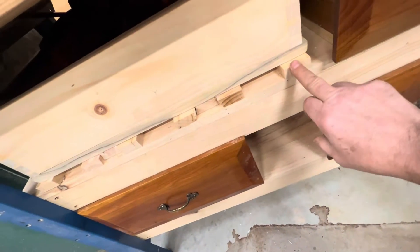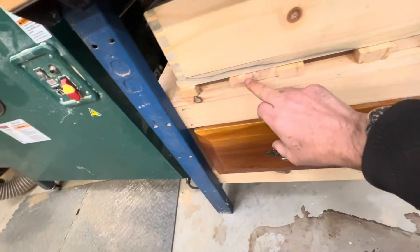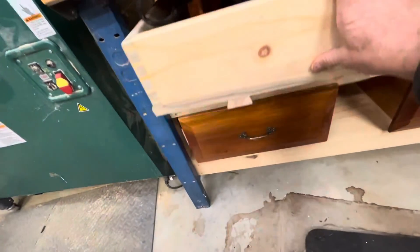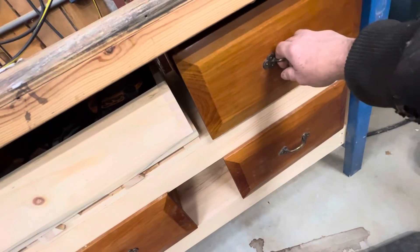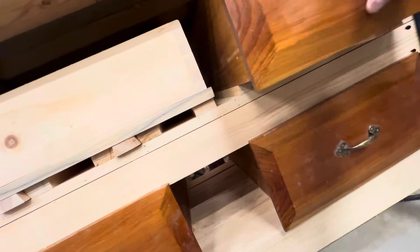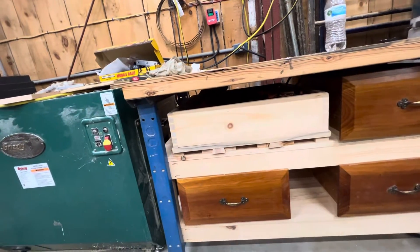You can see how the dovetails hold your drawer in. This is just sliding on top with a little bit of soap — a little bit of soap on these angles here for lube, a little soap over there. I've got them all organized in a drawer. Same thing over here — these are old drawers that we took out of a job and had to remake. I've got the same assembly underneath them with one dovetail, and they just slide on the corner of the drawers with some soap.